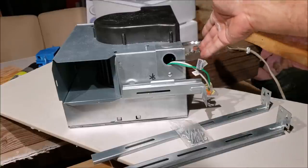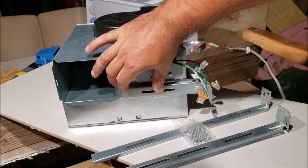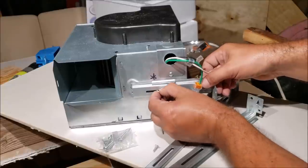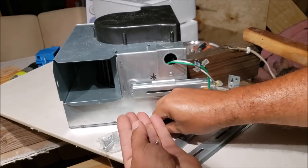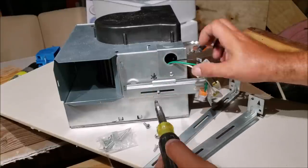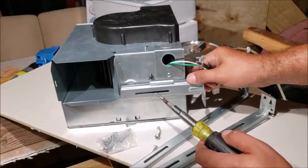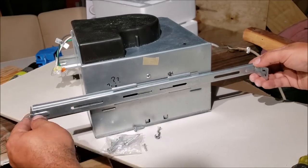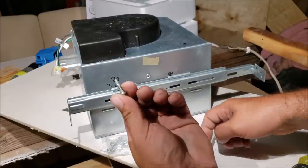I'm going to mount mine as-is because I want insulation to pack in there. These little holes — once we get this set in the ceiling — we put a set screw through to hold it so it doesn't move. The kit came with three set screws, but the problem is they are not long enough and don't reach, so you'll never get them threaded in that hole. I had to get my own screws: three-quarters of an inch long. Don't get anything longer than three-quarters of an inch because it might hit the fan. Once in position, see how it ties everything down — everything is secure. On the other side, the two set screws are also too short; the hole was covered on mine so I had to use a self-tapping screw. You need to have these screws in there.